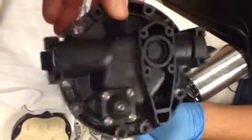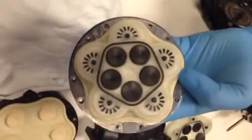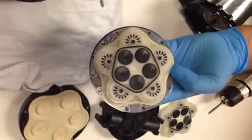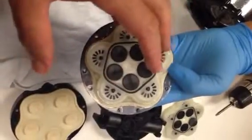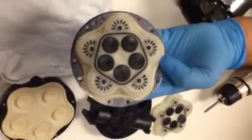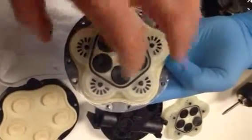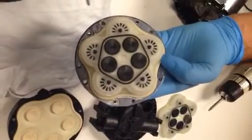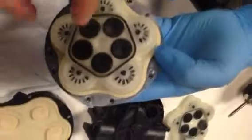The second part is the valve housing assembly. What we most commonly see here is debris from possibly the lack of proper strainers or inline strainers: debris, hair, debris of different sorts may get caught up in these orifices here, and if it does, it clogs the pump and prevents it from performing to its full performance. So we would immediately look for debris in the area.